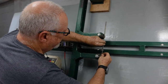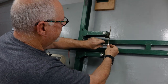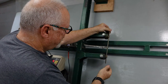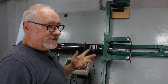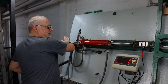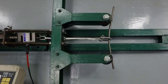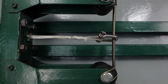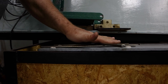You must remember this is actually thinner by 0.2 of a millimeter — so you're not really testing apples with apples. Correction: this is 7mm opposed to 7.2mm of the stainless, we're not really testing same for same. Let's take it to 220. 220 it is — backing off. Just starting to show something.